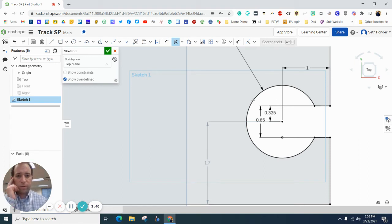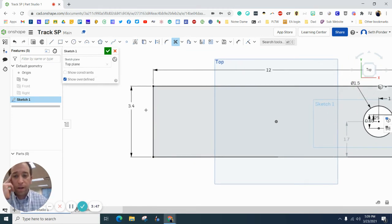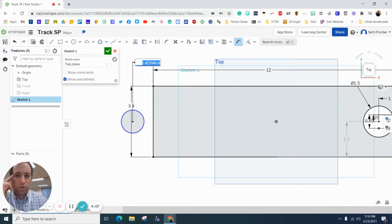Now on the other side, we're going to add this part. Let's grab the center circle and hover from this center point — you can see that dotted line being created — and I'm going to draw a circle. I want to locate the center of that circle from this line to also be an inch away, so they line up. I want the size of that to be slightly larger, 1.4 inches. I've got the height to location because it's 1.7.